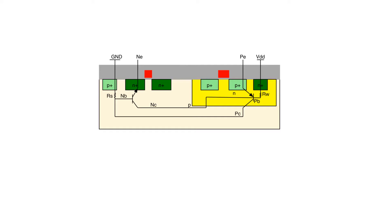This parasitic bipolar structure, in steady state or in normal operation, is not going to be very dangerous, because when we extract it and look at it as a schematic, we will conclude that it is nearly impossible to turn on. So whereas there are bipolar transistors here that were created unintentionally, these bipolar transistors seemingly cannot be turned on.